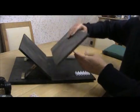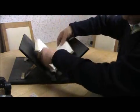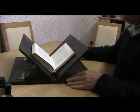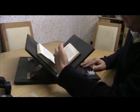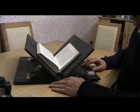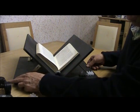The book goes inside that area and fits right nicely to give the width of the spine of the book. That's the base, and remember the base just moves — it can move left and right to allow for the thickness of the book. The platen will come down at this point at the beginning of the book and will be further over at the end. There's a slight amount of left-to-right movement needed, so it is completely independent and not attached in any way to the rest of the frame of the scanner.